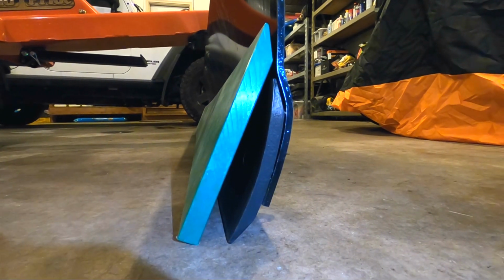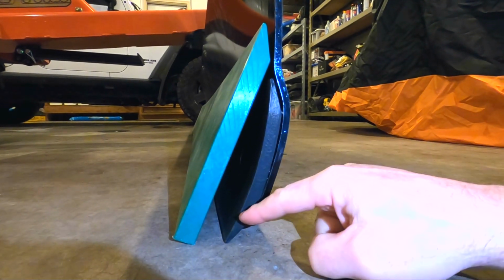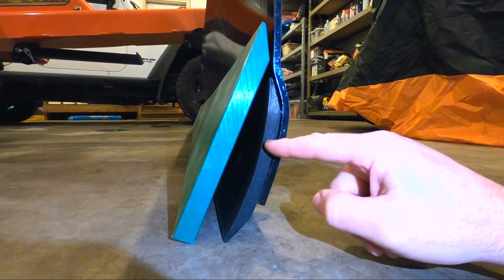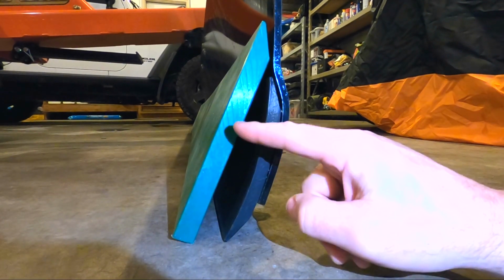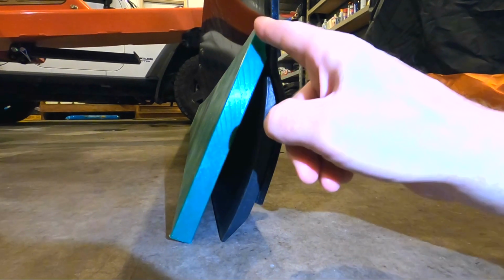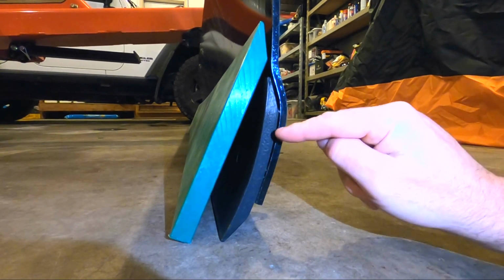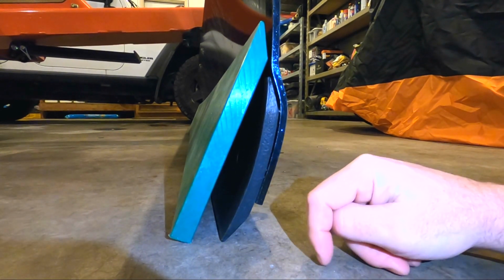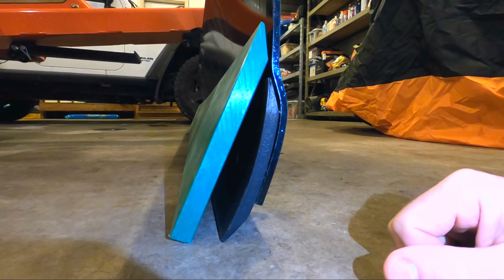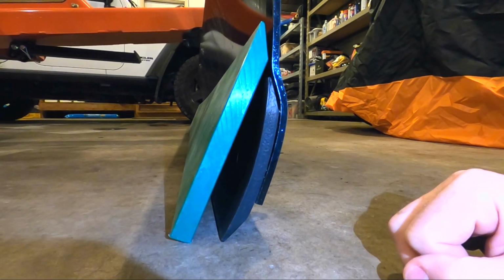All right, we are looking down the profile of the blade here. So here's the plow blade. This is the metal insert, basically for gravel and dirt. So we're going to take this off, and then this is the new plastic blade. I know it's not exactly the same size, but it shouldn't matter. You can see that angle right there is pretty close to that angle. It's going to sit in here, and we'll bolt it up. That way this can wear down and take the shape of the ground and won't damage the asphalt. So pretty straightforward project.